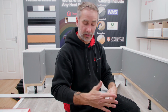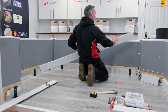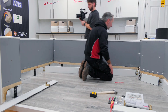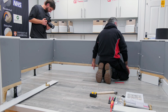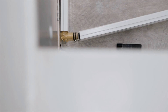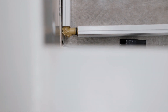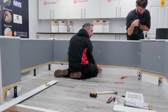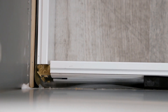Once that's done, push the elbows right into the skirting — this allows the next piece to go on nice and easy. At the internal corner, align the skirting with the fitting and go off sound: make sure the clip slides down the back of the fitting, offer the skirting up to the o-rings, give it a wiggle, and listen for the clip engaging into the connector. Then push the skirting onto the ramp of the bracket, slide up the first one, the second one is also engaged, and the third — push the skirting back and it's all clipped in place.